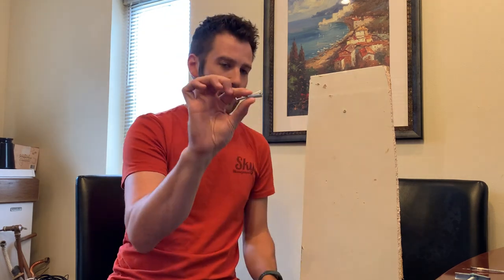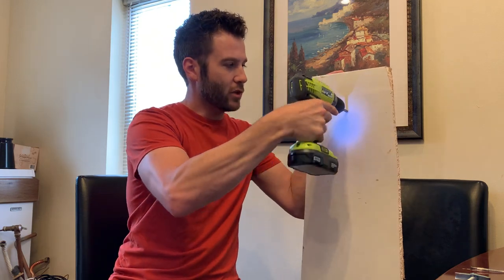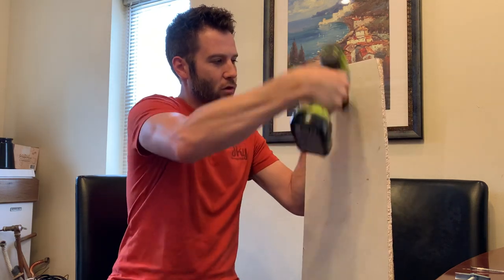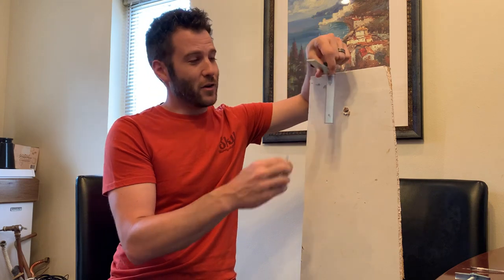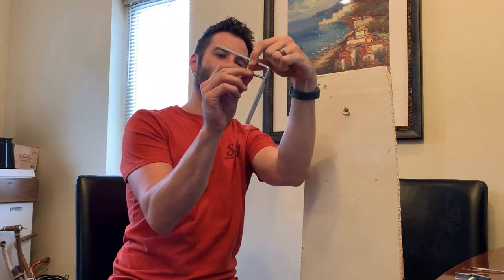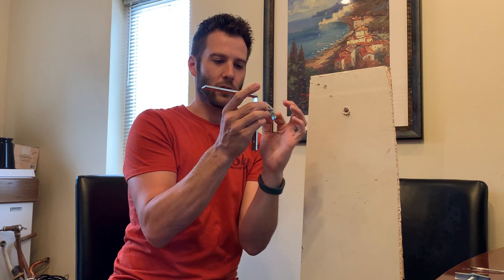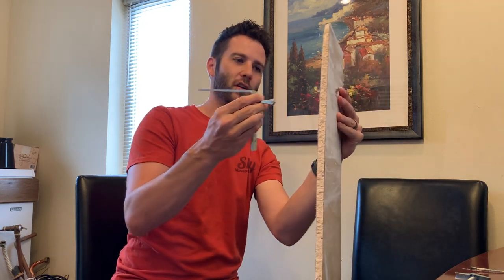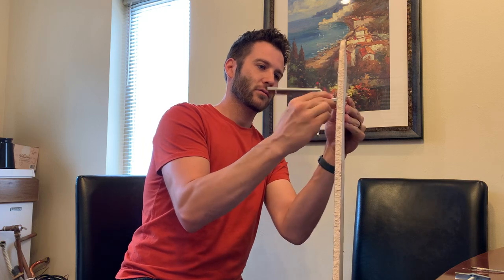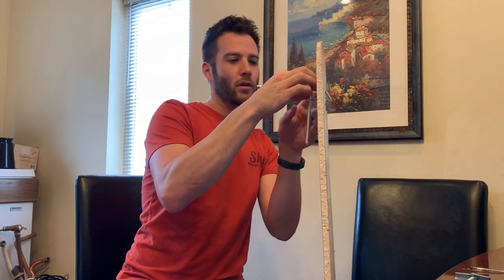As you can see, this is not going to fit through the existing hole because it's too big, so a lot of times what we'll do is take your screwdriver, put it in there, and just waller out that hole and make it a little bit bigger. It looks bad, I understand, but don't worry — it gets better. You've got your shelf bracket — you want to make sure you put this bolt directly through there first, and then lightly put the anchor on the end here enough to get it started. Then it's going to be pinched together and pushed back through the drywall, where it will spring open back behind the drywall as an anchor.